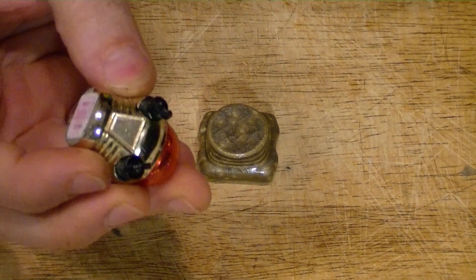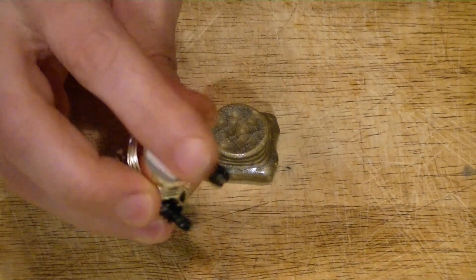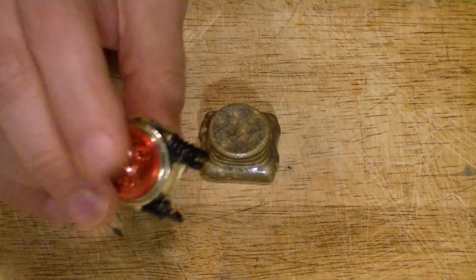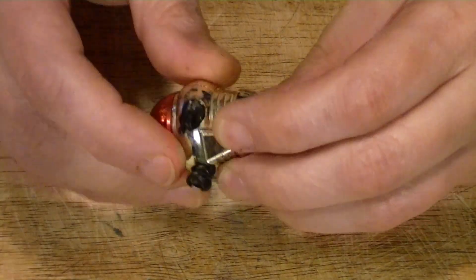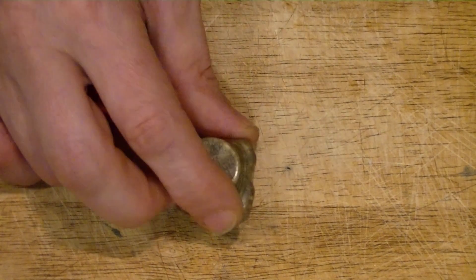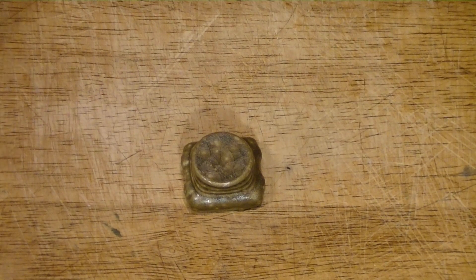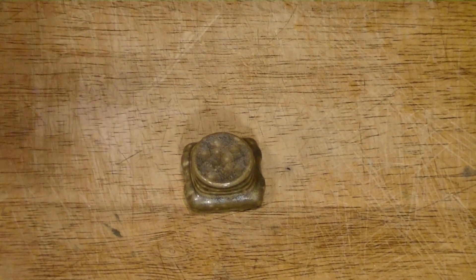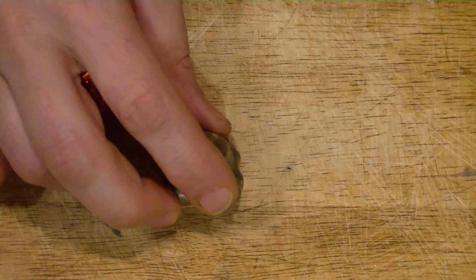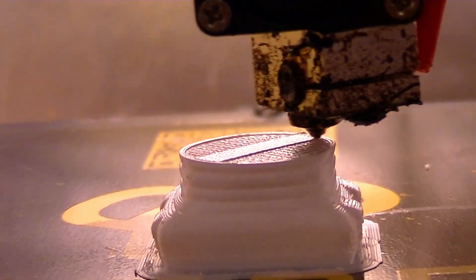Here's my idea. I'm going to start with this piece of the little robot. I've cut it off — it's flat here and filled inside with clay so none of the silicone can seep in when I make the mold, but it doesn't have any feet. So I went to Blender and modeled out a bottom piece. I use Blender because it's powerful, free, and similar to what I learned to model on. Then I printed it out in ABS plastic, which is normally what I use.